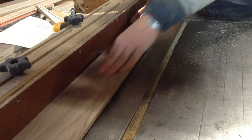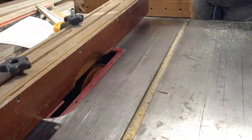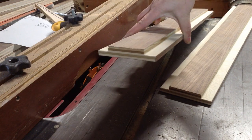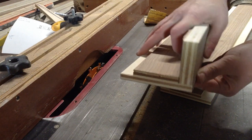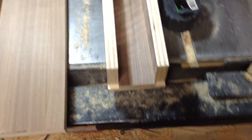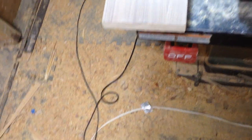This is the back side of the cradle — it's almost exactly the perfect size to fit in the back. I leave a little bit of space to account for seasonal movement. The plywood won't be an issue but those big beams on the table might move a little in the summertime. You can see it's a little shy of the front so it won't hit the sides at all — that's the back side with the two sides in place, and the linear actuator will sit in between.